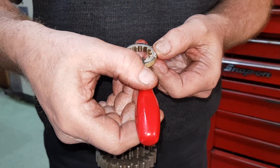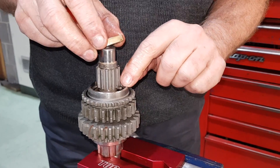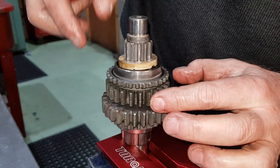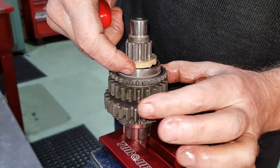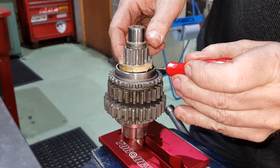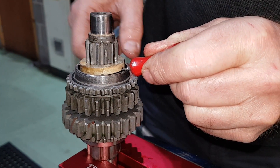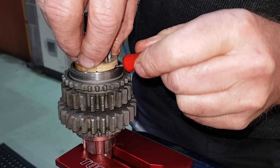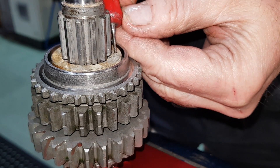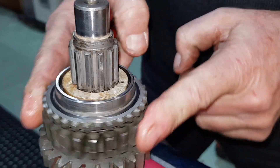Make sure that recess is located directly over the top of the plunger, then bring it down. You'll notice there's no hole in this gear — why they don't put a hole in it, I don't know, but that's the way it is. So what we've got to do is use a little tiny punch plunger, push in until it locks into the back of the hole, then push this down. As I push it round, you'll see the plunger pop out. So that gear is now locked in place.